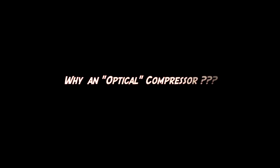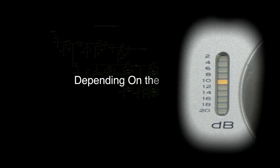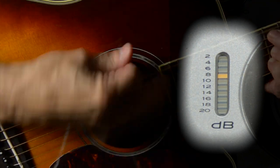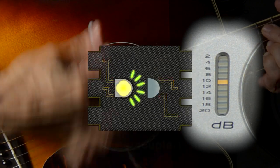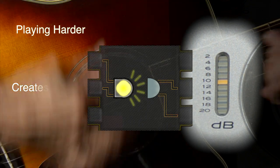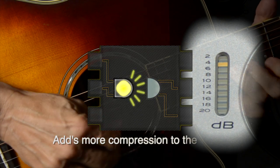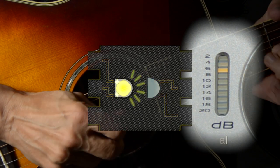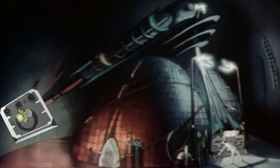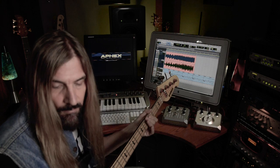So why an optical compressor? An optical compressor automatically adjusts its own attack parameter values depending on the input signal, meaning it makes its own adjustments depending on your playing style. An optical compressor also works differently from other compressors because it uses a light source and a photo cell. The harder you play, the brighter a little light bulb lights inside the unit. The greater the amount of light the photo cell sees, the more compression it adds to the signal. Rather than using off-the-shelf parts, the engineers at Apex designed their own optical elements specifically for the sound they were looking for, which was transparent and uncolored. In this way, your dynamic range is under control, but the compressor won't change the sound of your tone.